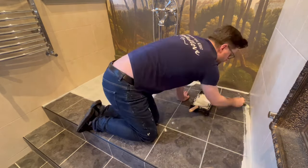So what you could do at this point is, you will need to take another day over it, but you could lacquer the whole surface, your base coat. You can lacquer the whole room and leave that to dry overnight. And then when it comes to your stencil pattern the next day, you just go over the top of that, because chalk paint will go over lacquer. And should you have a mishap at that stage, you can just erase it with a damp cloth and start again. So that might be something for you.